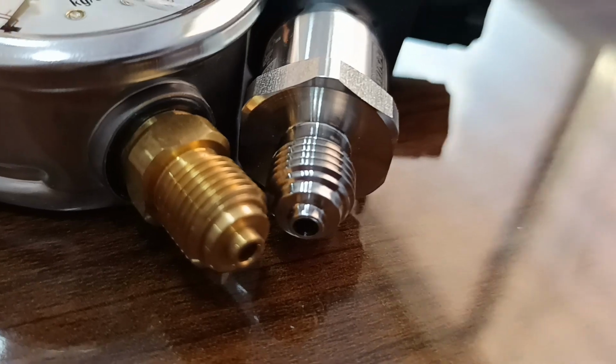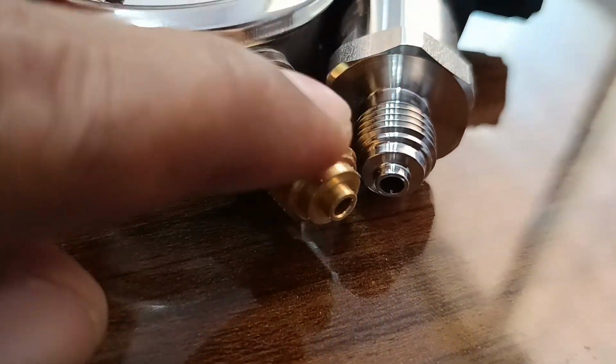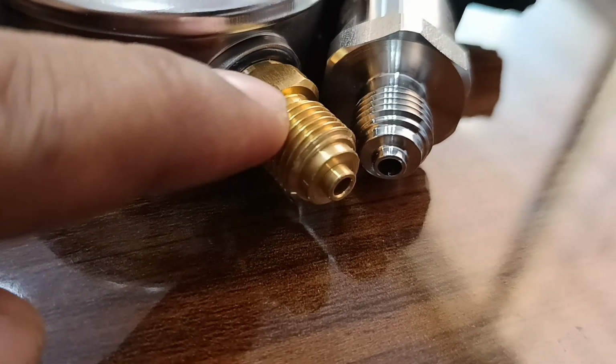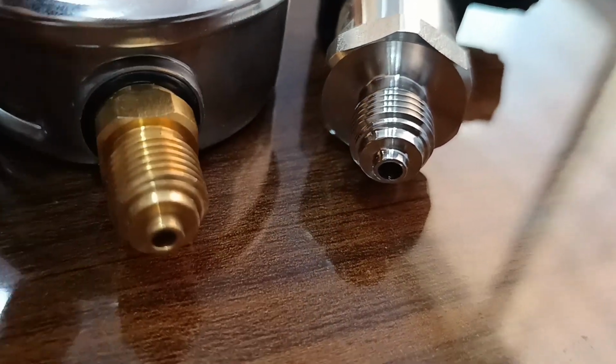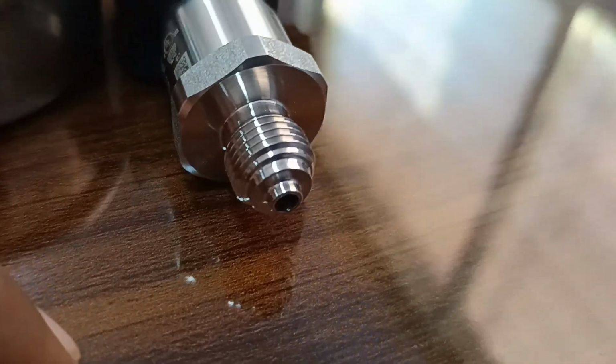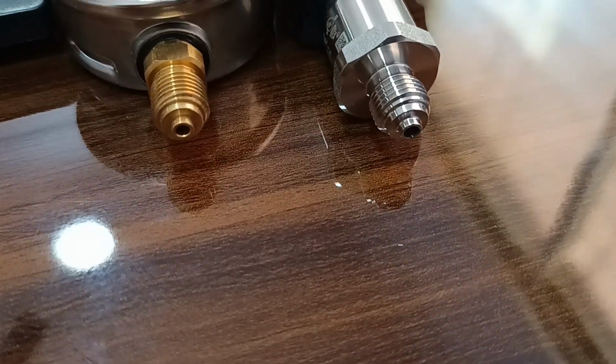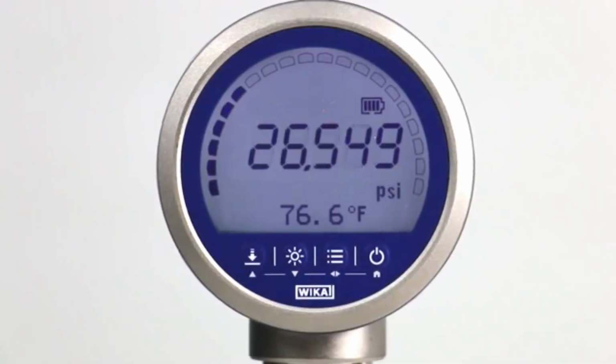5. Material compatibility. Connection material. Choose materials that are compatible with the fluid being measured. Brass is cost-effective and corrosion-resistant, while stainless steel offers exceptional durability in harsh environments. There are many factors included in this, like seawater, which is salty, so stainless steel can corrode when exposed to seawater, but some grades are more resistant than others. Here you can use stainless steel 316L.